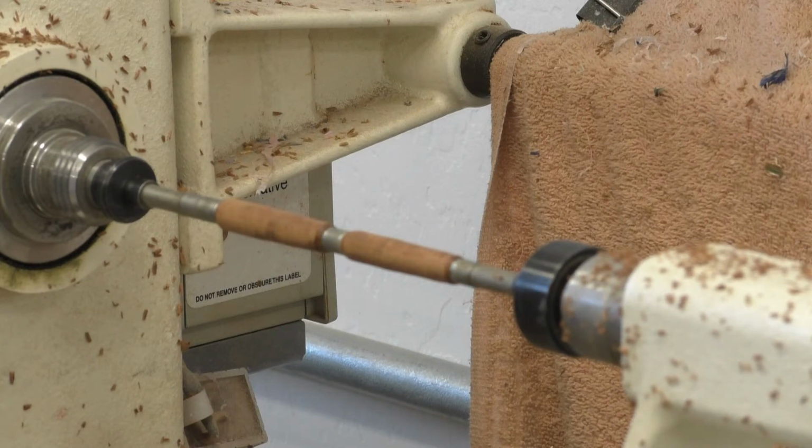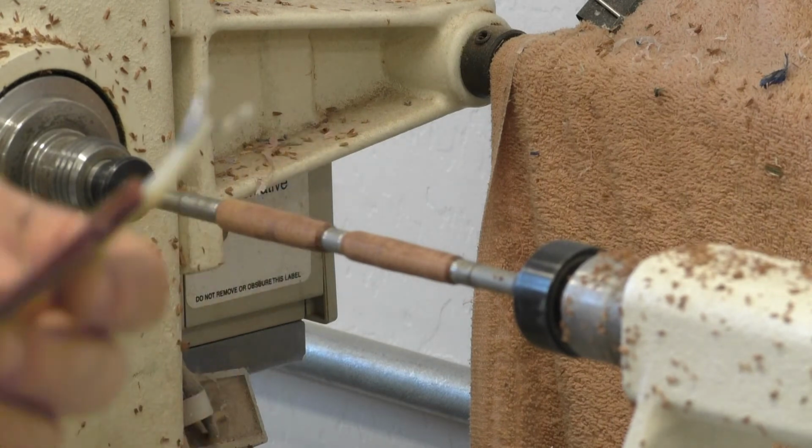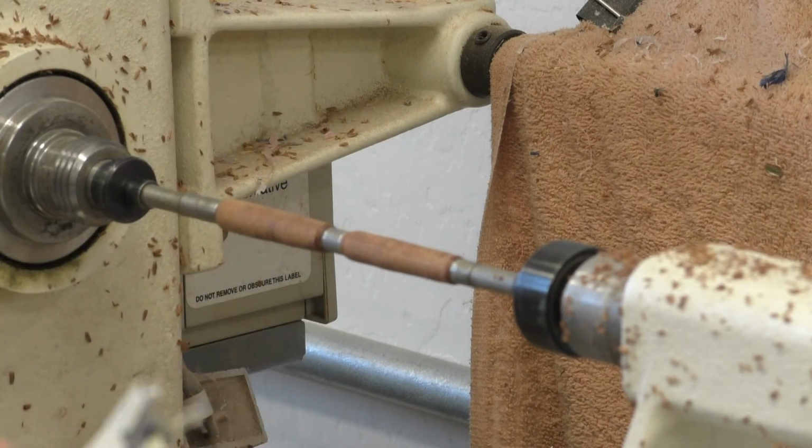All right, so what I've assembled is 100 grit sandpaper. I just cut them up into these little slices. You can buy rolls designed for wood turning, but I find this is more economical. So 100, 150, 220. We're doing wood. We do not need to sand up to 1,000. If we were doing a plastic, like an acrylic blank, I may take it up to 12,000 grit. But with this, and given we're doing the CA finish, 220, maybe something in the 300 range would be tops.